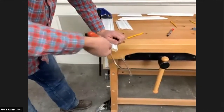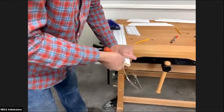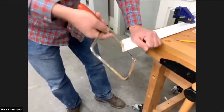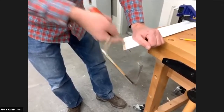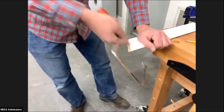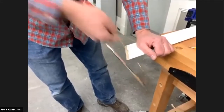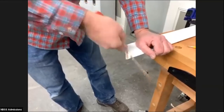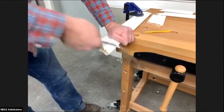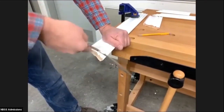Here's cut number two. I'm going to move my setup just a fraction. When you're cutting using a coping saw, use a blade that has 15 or 18 teeth per inch — tiny little teeth. You're not going to try to force the blade. Just keep the saw moving, going back and forth, letting the fine little teeth do all the work. I'm going to track right along that pencil line, right down my profile. Normally I'd blow off that sawdust, but not with a mask. I'm tracking right along that profile I traced with my pencil.